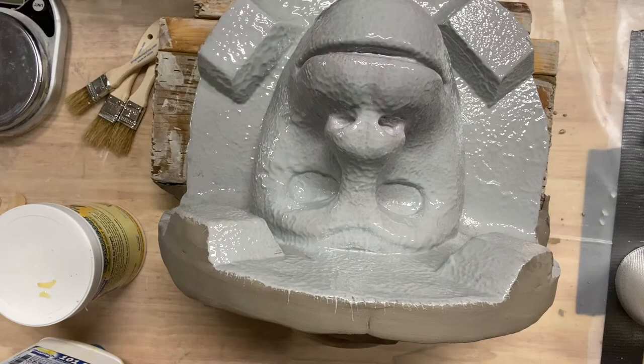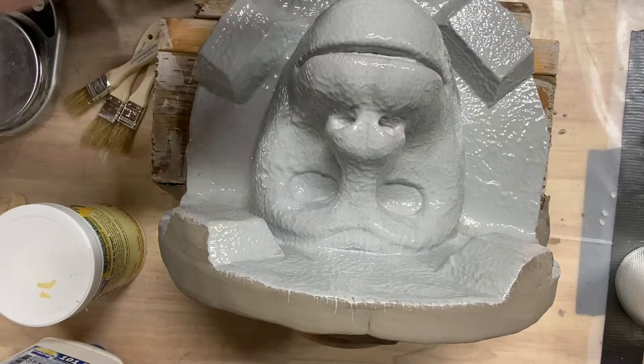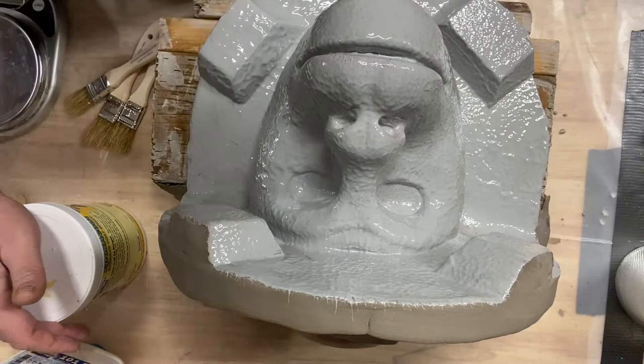So you can see I've got my air compressor running right now. You can see it wrinkles up, but none of that epoxy coat flies anywhere. It just resettles, thins out, and evens out. I'm going to do that process with each layer, probably at least four layers of epoxy coat, and each layer will get a little bit bigger with each one.